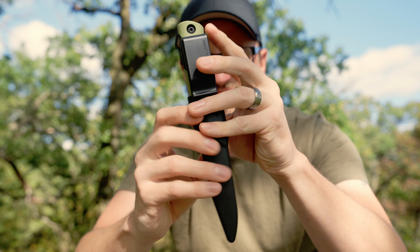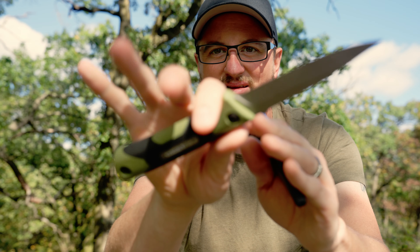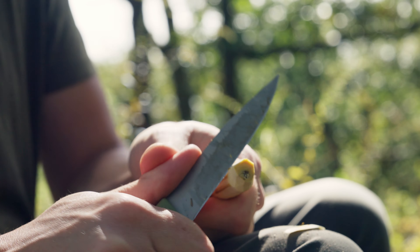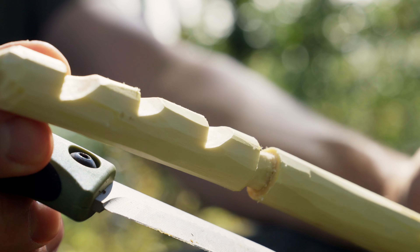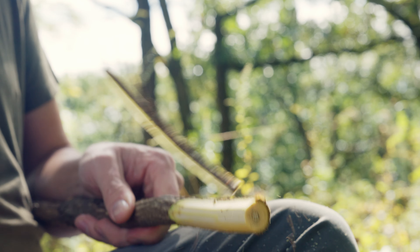First up in their line is the Senga knife. It has an overall length of 9.13 inches with a blade length of 4.13 inches. The blade shape is a lot narrower than most knives, and that's going to help with detail work and piercing. Ulfaworks is known for their edge retention, and on the Senga knife they actually ground it with a convex edge. That's going to give it a lot more durability and edge retention because you've got a lot more meat in the cross section of that blade profile, so it's not going to chip out as easily.